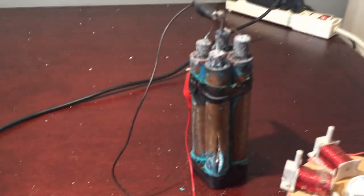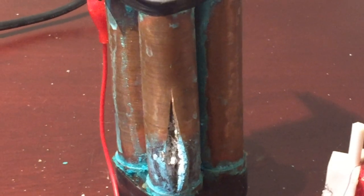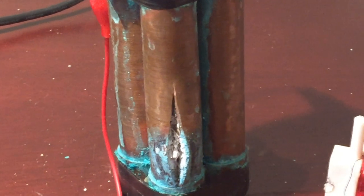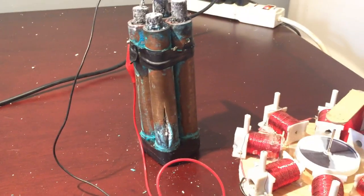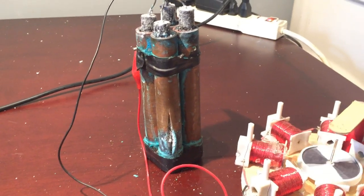What's bringing this one to an end is the crystal cell growth. The magnesium rods may have come up out the top just a little, but the bigger issue is the internal pressure ripping the seam. You can see the fresh copper color at the top of that V showing very fresh copper as the seam is ripped — I just noticed that this past week.